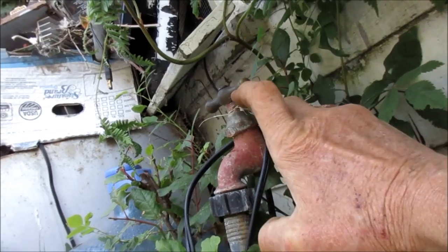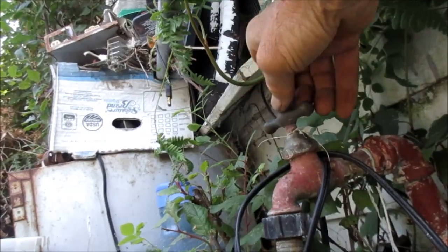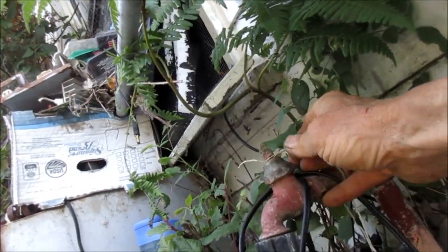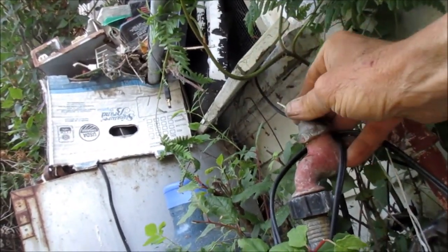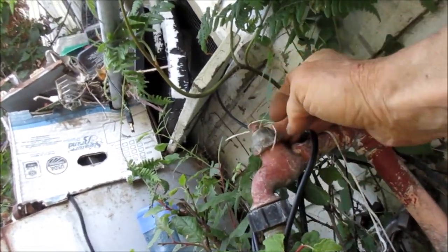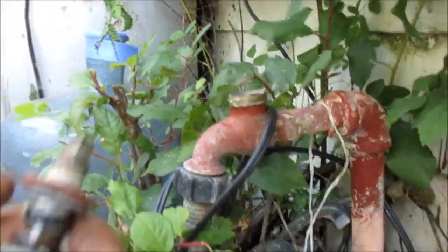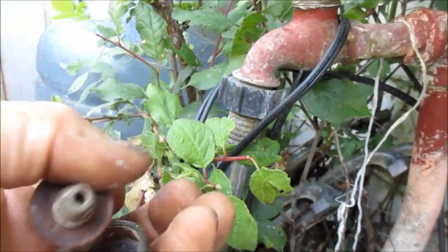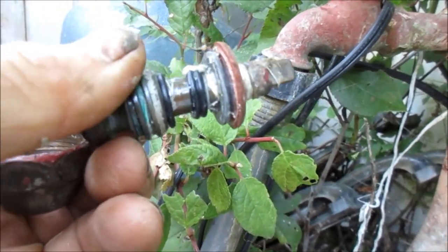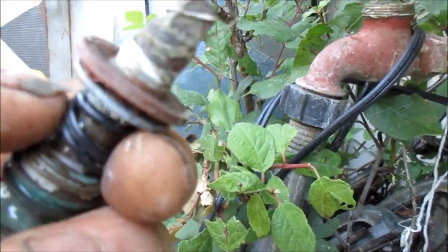This screw is not too tight because I recently put that Teflon tape — plumber's tape — on there, and it didn't quite work as well as I thought it should. So I'm going to go ahead and put the stem packing in. Let's take this nut off first — the water is already shut off. You can see the shreds of white Teflon tape on it. I tried to sort of MacGyver it — it's actually got some funny little washers or O-rings on it too.